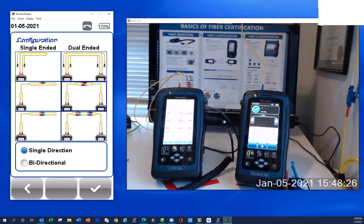With a three-jumper set reference, you'd be cleaning 12 end faces — one through twelve. It's important to also look down inside the end face to make sure that's clean as well. In training, people ask why it's called three jumper when there are four connectors. Think of it as hop counts between the testers: one hop here, two here — one, two, three for three jumper. So it refers to the number of cable hops, not connectors.